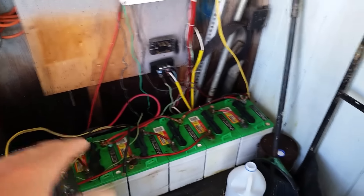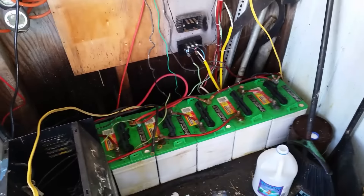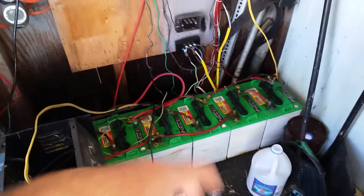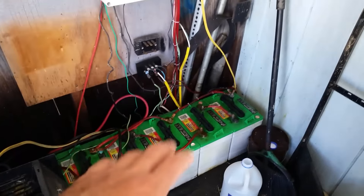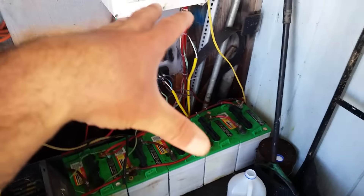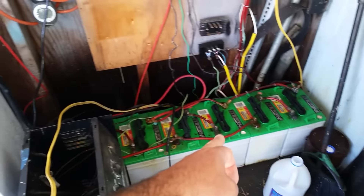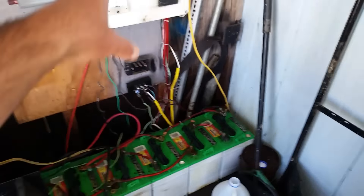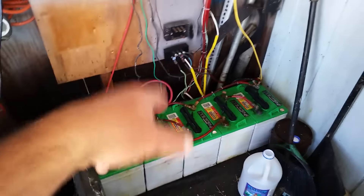Once they slow down gassing off, I'll unplug the solar panels and let the batteries equalize for about four hours. Normally my batteries don't ever just sit because there's always something running — the refrigerator and stuff. For the last three or four years I've been doing maintenance, and sometimes it's good to shut down your whole system, top everything off, let the batteries gas off. Normally if you have an Outback charge controller, it has an equalizing function that charges up to a top voltage, shuts off to let the batteries equalize across the bank, then kicks back on.